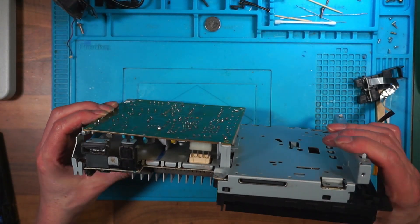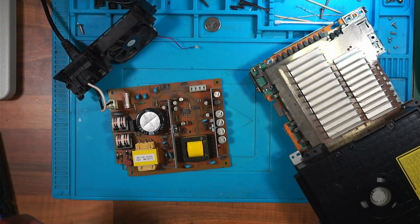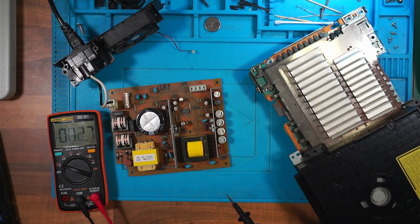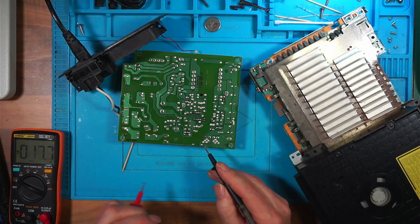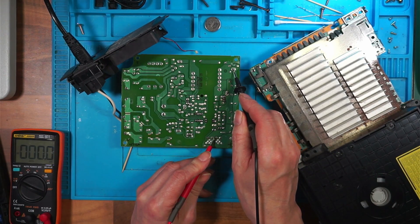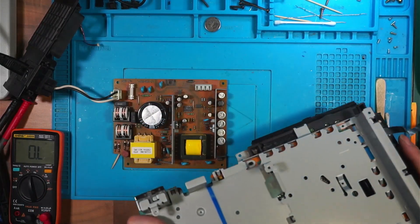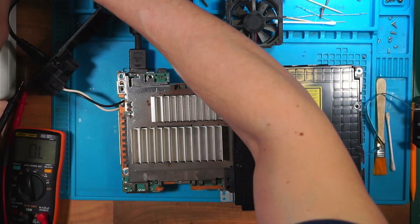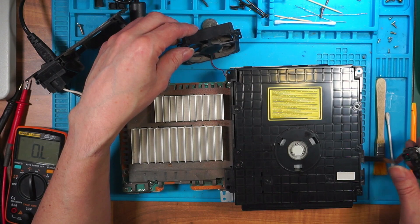Try not to touch this power supply because it'll have charge in it. Presumably I should have voltage on these pins - I'll just take the power supply out and see if I get voltage. Don't do this - this isn't a tutorial. Don't play with power supplies. Don't watch me and then do it and then blame me if you blow yourself up. Let's turn it over very carefully. Four pins - one's going to be ground, I suspect ground would be on the outside. Nothing, nothing, 12 volts, and 12 volts. I've only got one 12-volt rail coming from this power supply - seems a bit strange seeing as there's four pins. Now I'm getting nothing, no fan spin, no power, nothing.